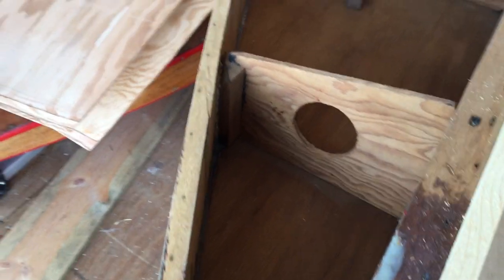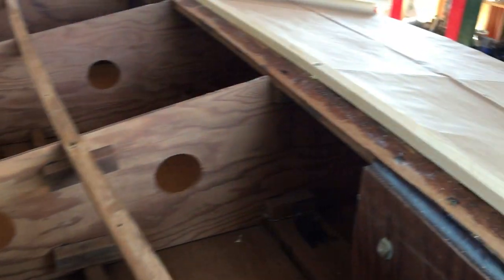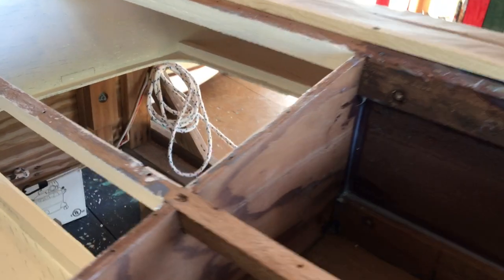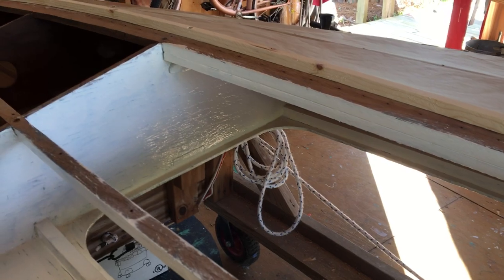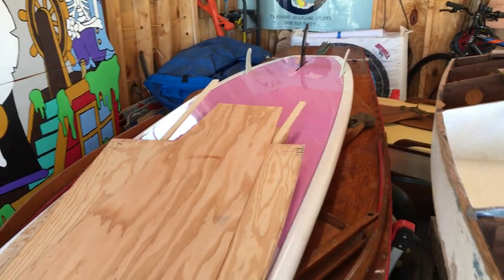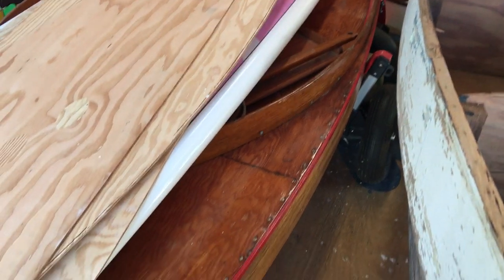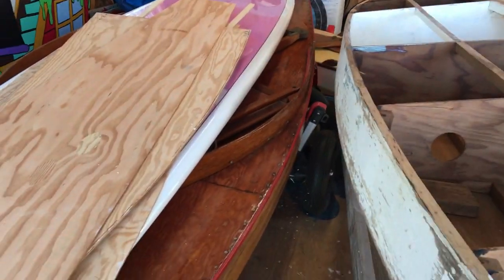The only areas it's going to be glued are along the edge and along the keel longeron. When we get back to the cockpit, it will be glued and screwed along this fore and aft cockpit panel and then back on the stern. That's one of the reasons we liked sanding all the paint off — we could see where all the fasteners were on the side and on the deck, and we got pictures and notes of that.